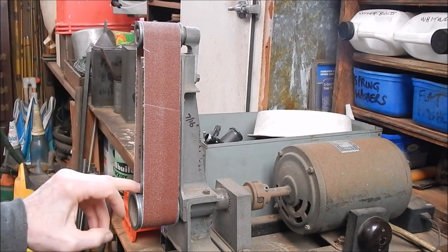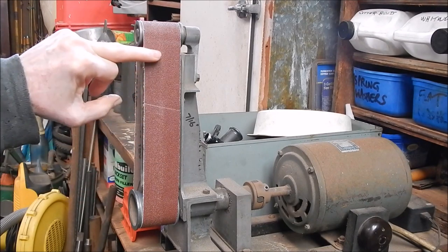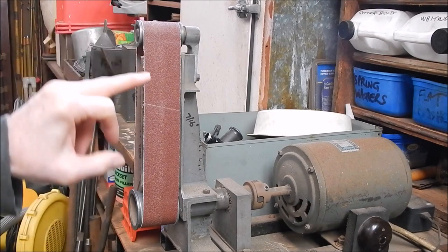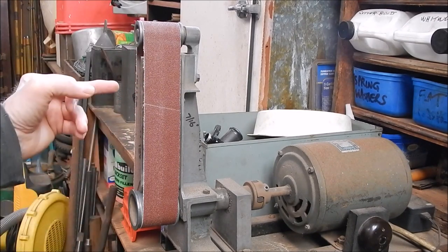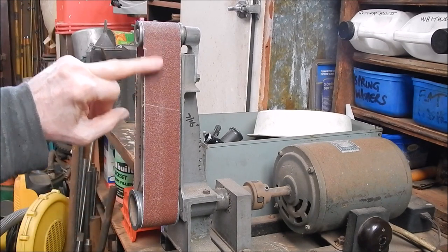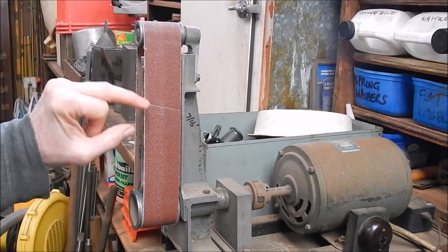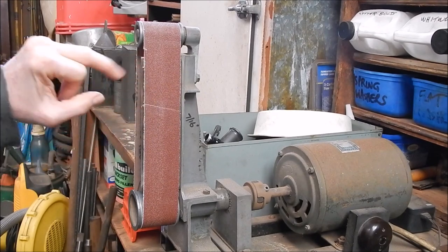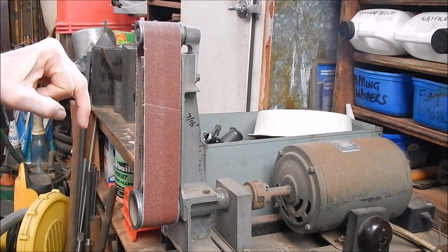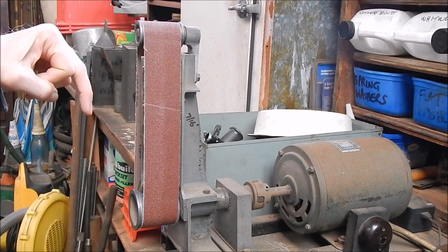So I finished up with all these sanding belts which had come apart. This is an obsolete sized belt — if you do buy these belts, they're hellishly expensive and very hard to get. But what you can do, as I showed you in one of my earlier videos, is you can get belts which are twice as wide, then you just simply tear them down — just stab them with a knife and tear them down — and get two belts out of one. Not only is it easy to do, it also saves a lot of money. When you buy sanding belts, it doesn't really matter on the size within a certain limitation — they all seem to cost about the same. So I can buy a wide belt in this loop circumference for, let's say, four bucks a belt, tear them down and get two out of them, so it brings it back to two dollars a belt.